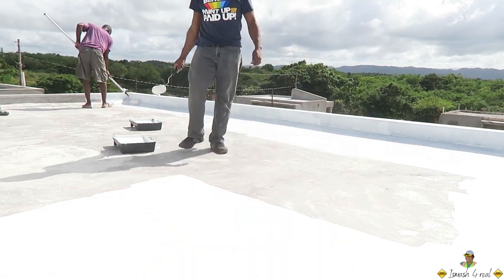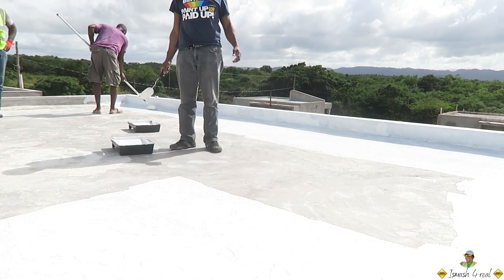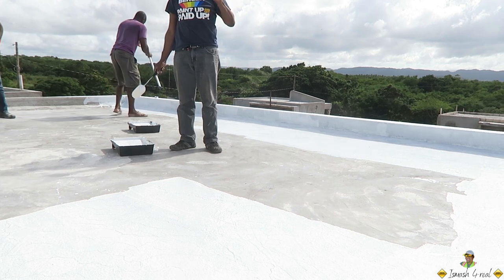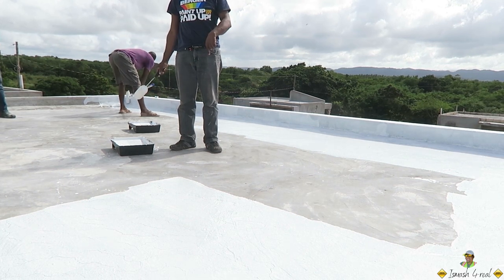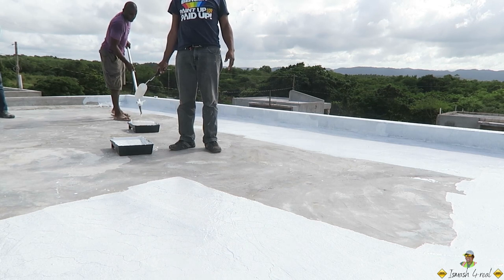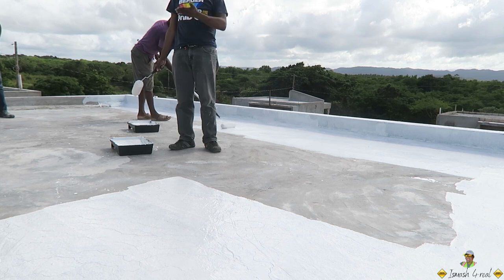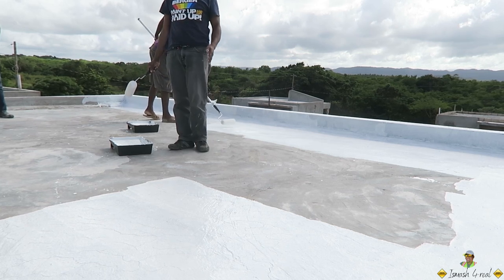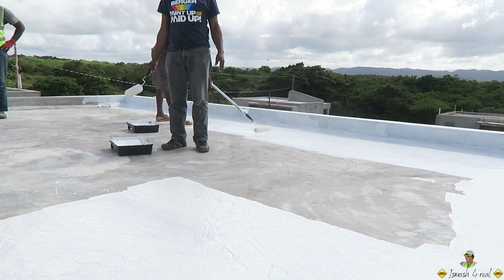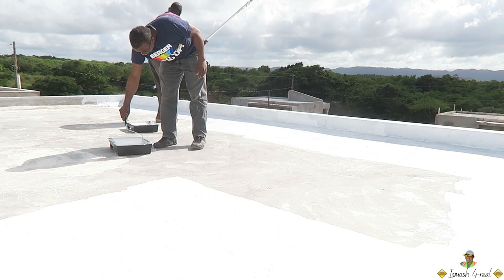But bear in mind that square footage is normally a theoretical calculation. If your surface is uneven, square footage assumes a completely flat surface, and it also assumes no penetration, because you simply take the solids and multiply by the spread rate. If you have penetration, like a very porous surface, or undulations, it's going to float and level. Here we expect a porous surface, since I'm putting this on concrete.